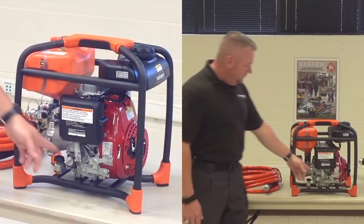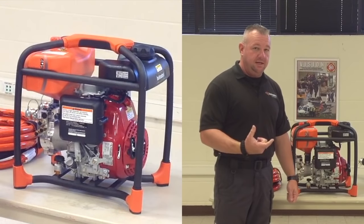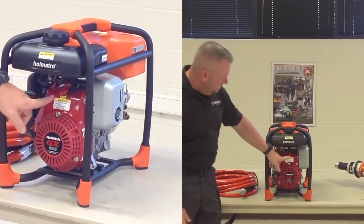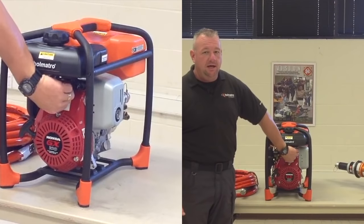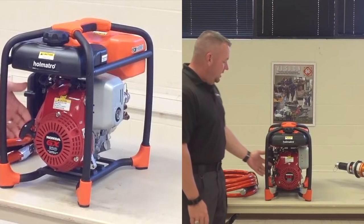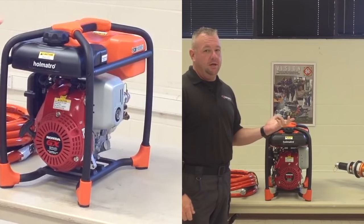Once you've checked the levels, move down and check the motor oil level. We use a straight 30-weight small engine oil. There's a port on either side you can check — unscrew it, there's a dipstick that will show you the operating range. Keep that in check. There's an on-off switch located below the fuel tank. If you reach in without looking, you'll feel an indicator on the switch — if the indicator is pointing over toward the pull rope, then it's in the on position. It is an easy-start engine, so there's no need to jerk on it; you can actually damage it by jerking on it. It's just one smooth pull. It may take a couple of pulls to prime it and you're ready to start.